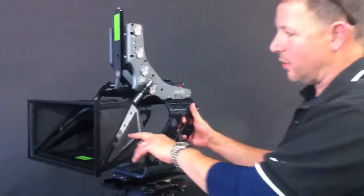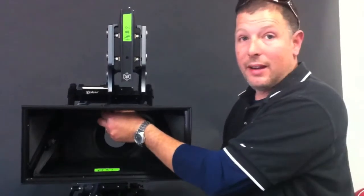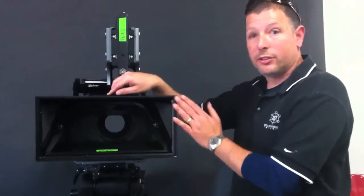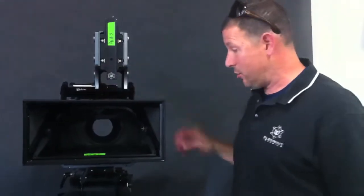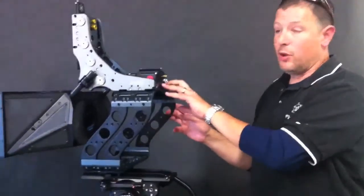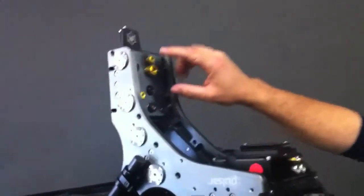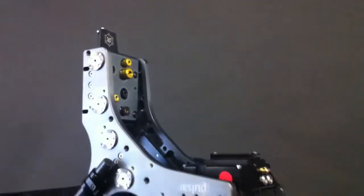They all have a mirror that's able to tilt. Mirror locks are in a slightly different place. There's a little knob for the actuator to turn it, and on the units we're shipping, the knob to adjust the mirror angle is on the outside — so if you have an optical flat or a filter in the path, you can still adjust the mirror angle while shooting. We have a similar motion module with integrated motors and electronics, and the same three knobs as on the Quasar to adjust roll, tilt, and Z-height of the camera.